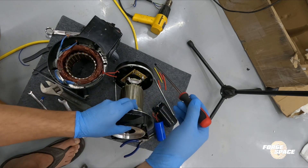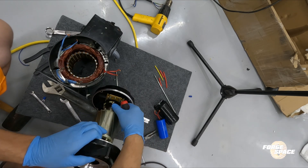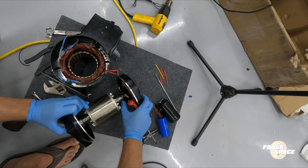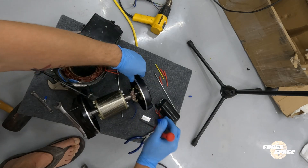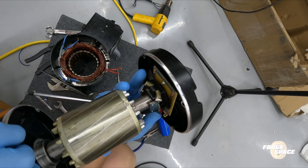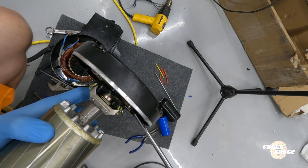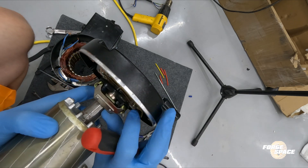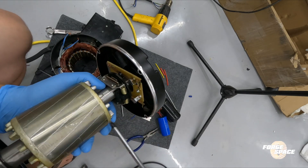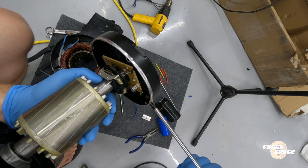It connects over up here, which connects to these. Once the motor starts spinning, it throws the centrifugal weights out, which then bypasses the starting capacitor. Right now it's clicked in for the starting capacitor. Once it's spinning, the weights pull outwards and they disconnect the starting capacitor and bypass it, keeping it engaged. Now the other side has your running capacitor.